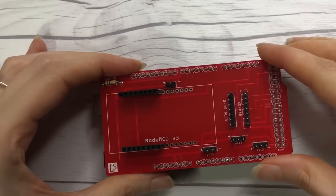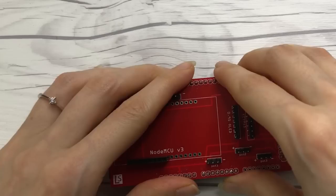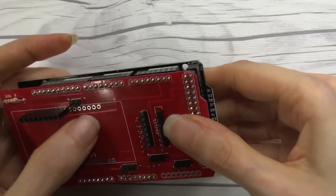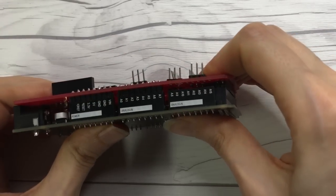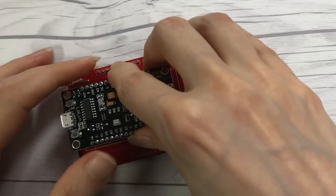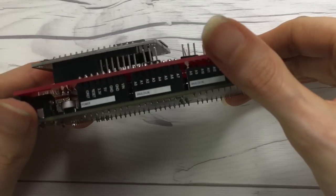The way I made the PCB board was to make it as a shield for the Arduino Mega that I was using. I needed to use the Mega because I was running out of memory a lot, and the Mega has more memory. The shield option made it fairly compact, and I could also board the Wi-Fi board on it. I used a more standardized version than the one I was using for testing. So it's a Node MCU unit. You can use those on their own, but the Arduino does all the calculations for the timer and so on.